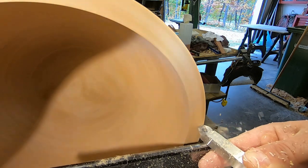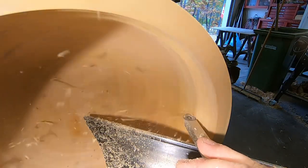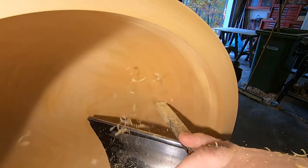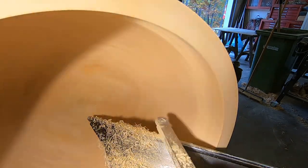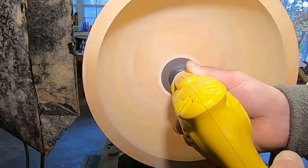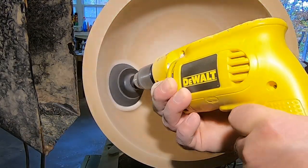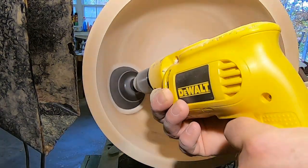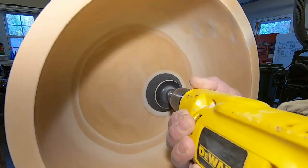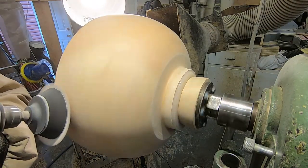Very light cuts. As always, I'm sanding from 60 to 320 grit, and those are the three-and-a-half-inch dimple discs from sandpaper.ca — there's a link in the description for them as well. I like to go forward and reverse with the lathe, and then forward and reverse with the drill accordingly. As you can see, it kicks up a pile of dust. I use a self-powered respirator — it's very important to protect your lungs here.